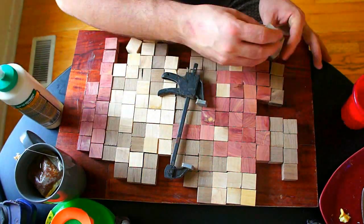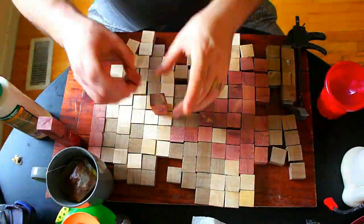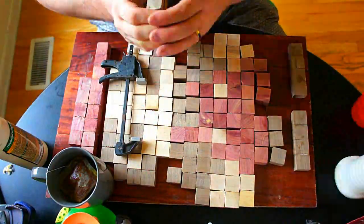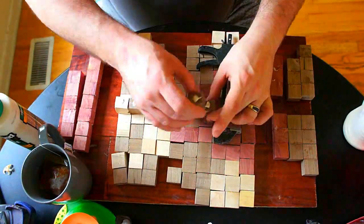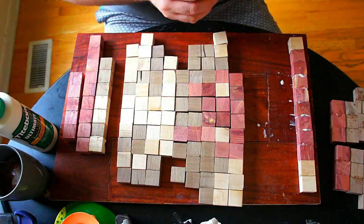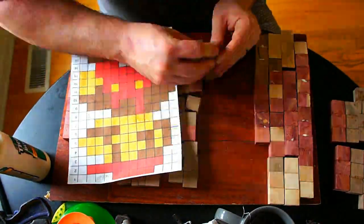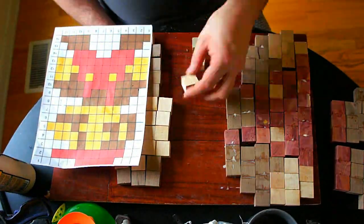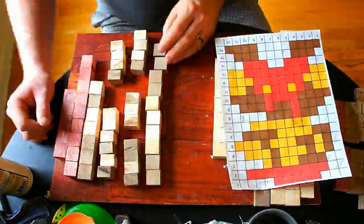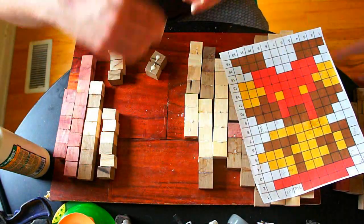Here's where I start the actual assembly and the glue-up with all these little pieces. I thought I was going to end up having to use clamps on all of it, but it turned out that the suction just from the glue on the little pieces was enough to keep them together while they dried. I wasn't really anticipating how much finishing all the little pieces would need after the table saw — they weren't all quite square, and they had a little bit of edges on them. I had to get all of those edges cleaned up so that they would go together in a relatively square manner.